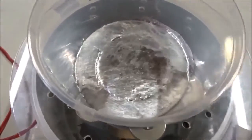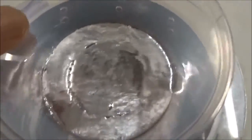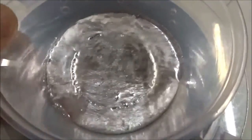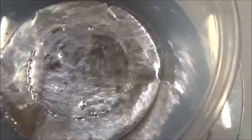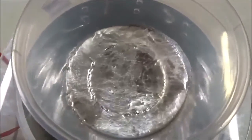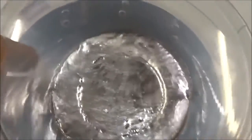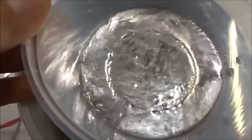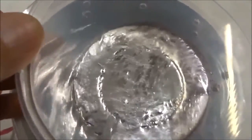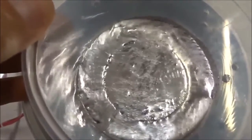Now it's also very interesting if we have six NSNS magnets and start spinning them and put liquid gallium over them at about 40 degrees, which is liquid, they'll also induce a spinning motion in the gallium just like they would for aluminium. Look at the vortex going all around. Very fast spinning vortex. Here is liquid gallium over six spinning NSNS magnets.